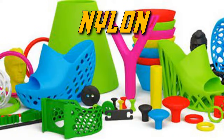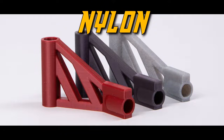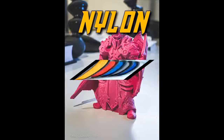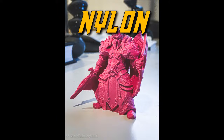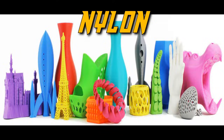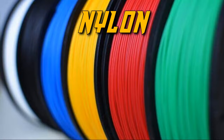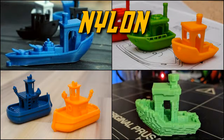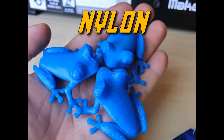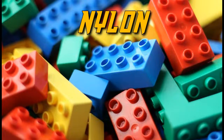How about nylon? Nylon is a very commonly used material in powder fusion method 3D printing, but you can get it in filament form as well. Parts printed from nylon are super strong, flexible, and durable. It requires fairly high temperatures — 240 to 260 degrees C — and a bed between 70 to 100 degrees C, which is just at the high end of the Ender-3 and its clones. It does shrink and warp, so if your printer is not enclosed, turn that draft shield on. It's also hygroscopic, so keep it dry. Due to its high strength and durability, nylon is great for things like tools and functional mechanical parts.